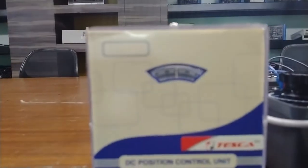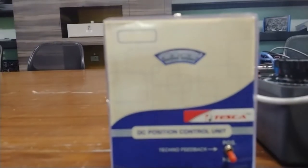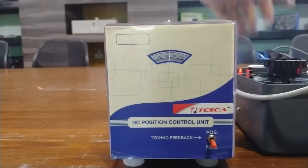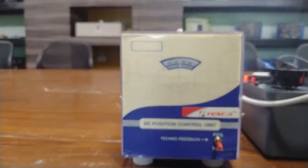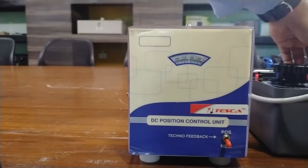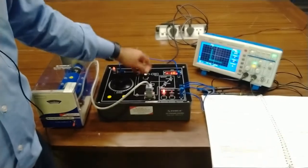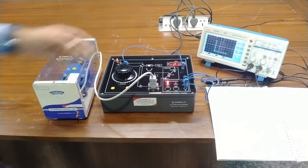You can see this is the 60 degree position. As I set the value to about 70 degrees and then change to 130 degrees, you can see it is reaching almost 130 degrees. This is the step command input from the reference command. Now we will increase and note down the values for different Ka values and make an observation table for different Ka values. You can also see the speed increases while controlling at Ka equal to 7.